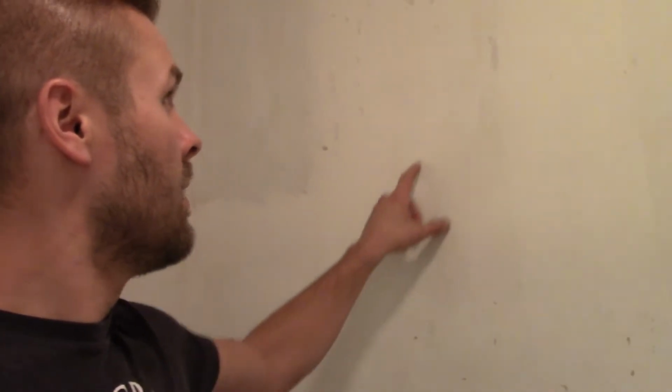So, like I said, I won't spend a ton of time on it. This room in here, I still haven't skimmed out yet, but I have taken the paint and went around and painted over all of the really bad torn into spots. But like I said, if you go back a couple videos, you'll be able to see how badly damaged that wall was. This is one skim, that's just painted, so no skim yet. So it does work. If you're having issues with that, you might try this method, paint over it, and then you should be good as far as your drywall.